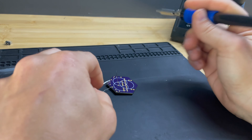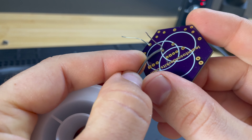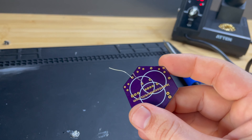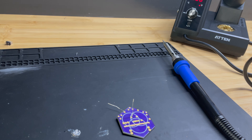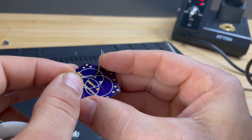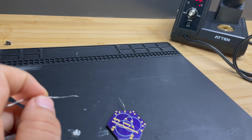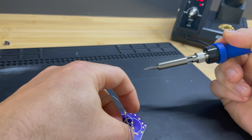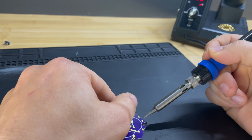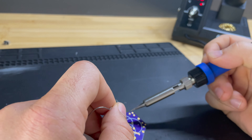It's a little tricky to do this with the camera. This solder in my hands is a little thick — a little big in diameter for the size of this pad and leg. Could it work? Yes, but I'd be even more comfortable using my other solder. This smaller diameter solder just matches a lot better with the size of the component and pad I'm working with, and that helps me avoid putting too much solder onto the pad and the leg. So I'm going to come in here and lightly touch this, let it heat up, and then put the solder on there and let it flow.